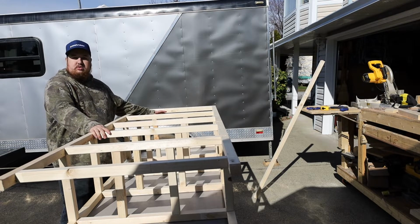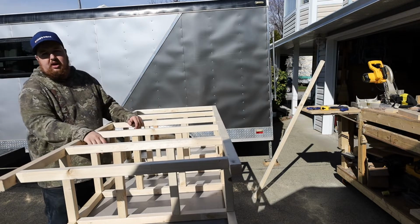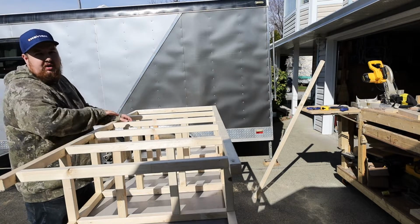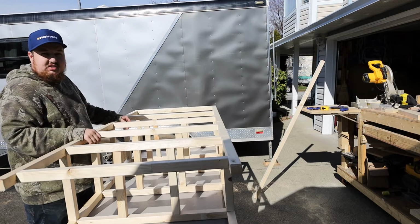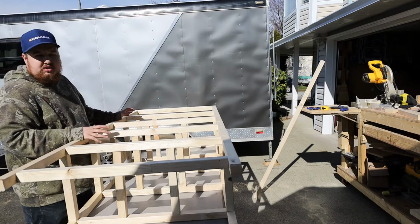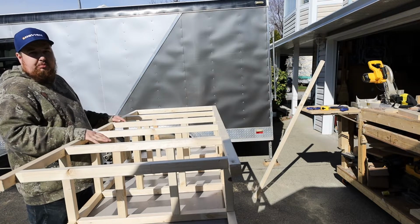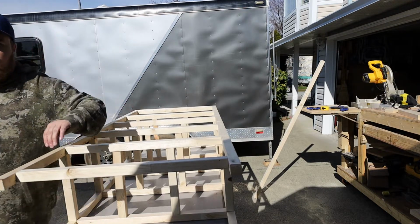This is kind of a dresser, but built into the trailer. We got a bottom one that's quite large for shoes and whatnot, and then the rest will be for clothes. We're going to put some white 1/8 plywood on the top, and then we will take our router and router out all the openings. I know you didn't see me build this, but it's just 2x2 framing, depending what size you need it and support. We'll get that plywood on and then we'll get it in the trailer, and I'll try and show you guys a little more.